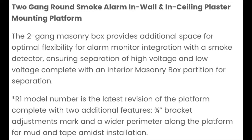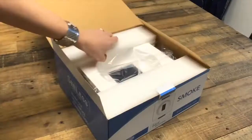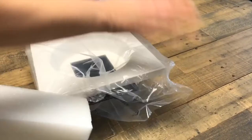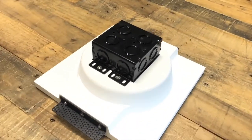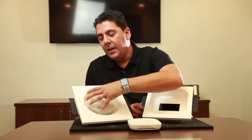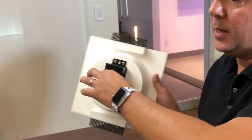So if you need to separate your low voltage from high voltage, you could easily slide in a divider. Some applications require the smoke detector to have both a high voltage and a low voltage condition — in that particular scenario it's a two-gang box. Most of the standard ones come with a single-gang UL electrical termination box.